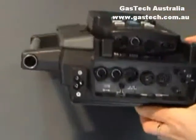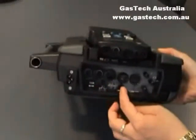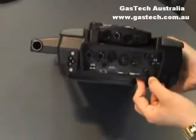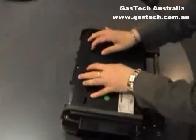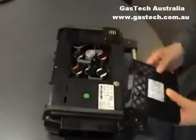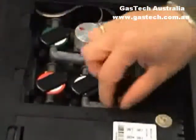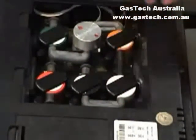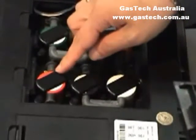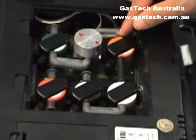There's start, which lets you choose how it starts — either manually or by date and time setting. There's mean, which lets you choose whether data is collected as a set and output as a mean, or whether you get each data point individually — just click yes or no. Measuring rate pump is the rate at which samples are taken; for example, if I put 9 seconds then a sample will be taken every 9 seconds, then press end to save it. There's also the end option — how measurements are ended — either when memory is full, by number of values, or through date and time setting. Clicking memory full will take measurements until maximum capacity is reached.